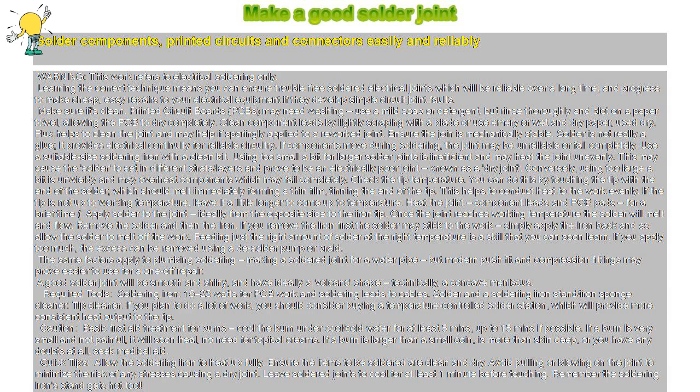Feeding just the right amount of solder at the right temperature is a skill that you can soon learn. If you apply too much, the excess can be removed using a solder pump or braid. The same factors apply to plumbing soldering, making a solder joint for a water pipe, but modern push-fit and compression fittings may prove easier to use for a one-off repair. A good solder joint will be smooth and shiny, and have ideally a volcano shape, technically, a concave meniscus.